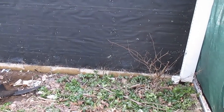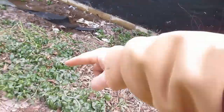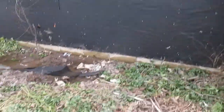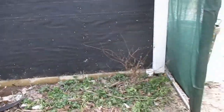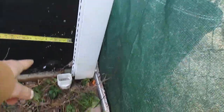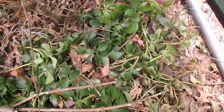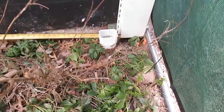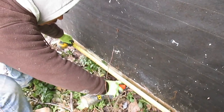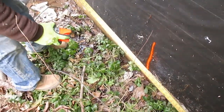We're gonna measure off the corner of the house, 4 feet. We're gonna go 11 feet off, 18 this way. So just corner of the concrete. See if you can find it down there. Can you find it? Yeah, somewhere down there. 4 feet. 4 feet? Here's the wall. That's the wall, outside of the wall, 4 feet. Put it 3, no? Put it 3. Yeah, you can put the mark at 3 for the overcut, sure. That's good.